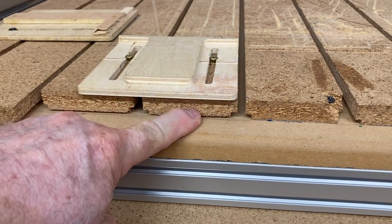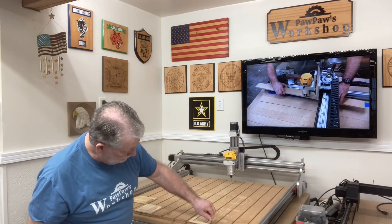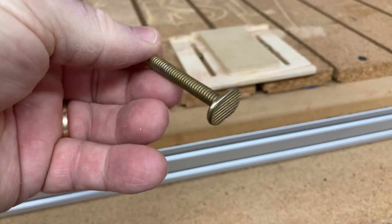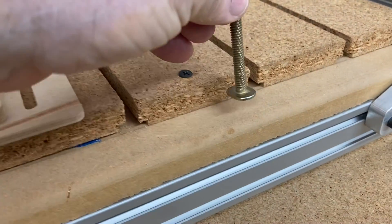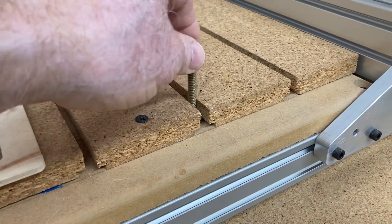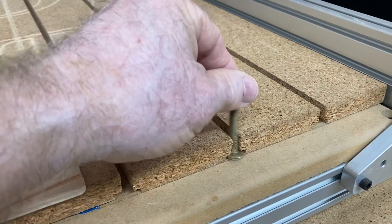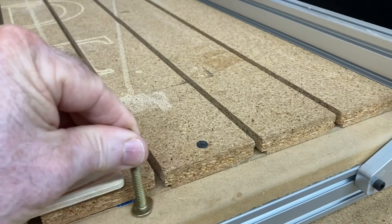On the most recent project, you can see where these boards raised up about one millimeter. The reason? These screws right here pushed it up. And that's what it's all about today - putting in a very efficient spoil board that is going to work now, in the future, several more years before I have to touch it again. The bolts I used were from the plumbing department. They slipped right in and wouldn't turn, making it a perfect opportunity to tighten and secure them in place.